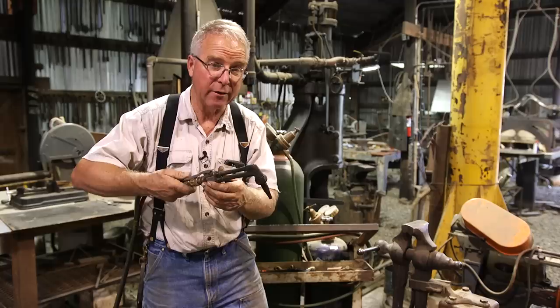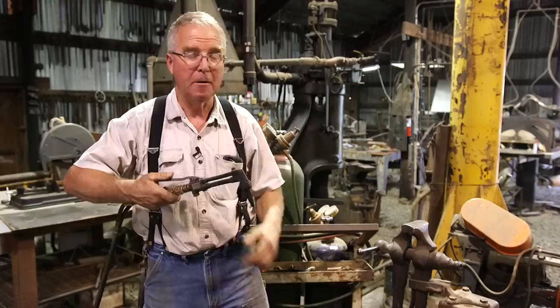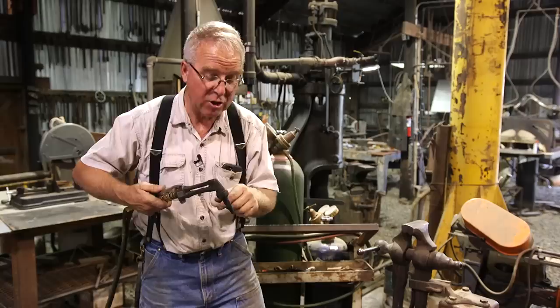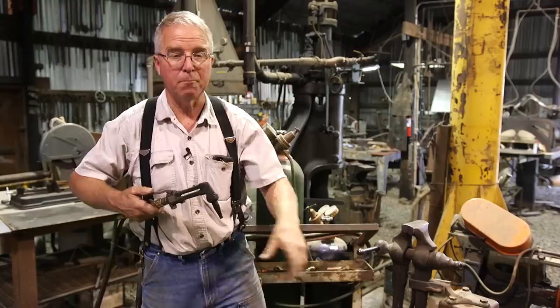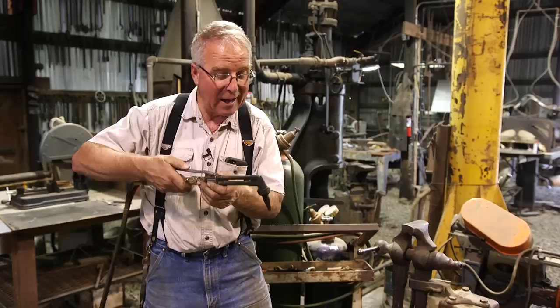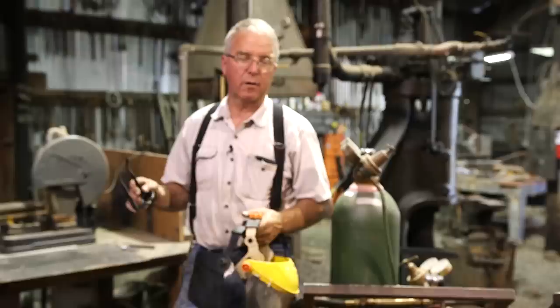You don't begin to move until the entire area is molten, the lever is hit, and you can see, probably through your peripheral vision, or perhaps looking down into the top of the pool, that the jet of oxygen has actually pushed the molten steel straight through the piece and out the bottom. At that point, just move steadily, slowly and smoothly forward, maintaining the right distance above the work, maintaining the right angle relative to the work, and moving forward at the right speed. There's nothing to it. Cutting steel with a cutting torch is one place that you darn sure better be protecting your eyes.